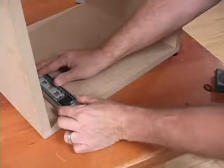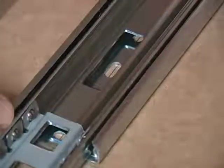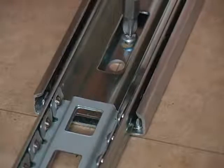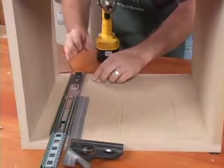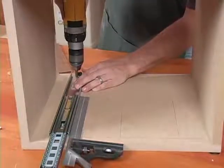Set the glide into position, aligning it with the 7-1/8 inch offset line. Pull the hardware out and, using the slotted holes, align it with the center line mark and drive the screw. We'll drive it most of the way in, do a final adjustment, and secure the hardware tight. Now use your combination square to square up the hardware to the front of the case and install the screws, being sure to use the elongated holes so that we can adjust the front to back later.